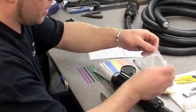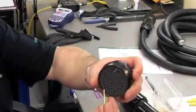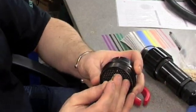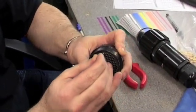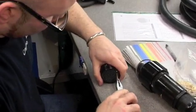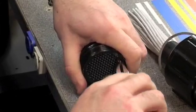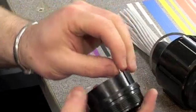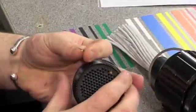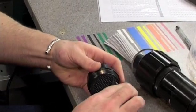Take the female connector. The female pin will fit onto the guide pin like so. Once you pop them in, the guide pin will help poke it through, and then the guide pin comes out the other side. You just repeat the process for each wire and each channel.